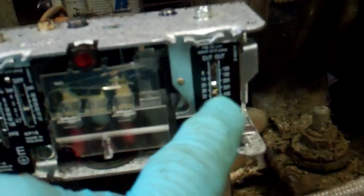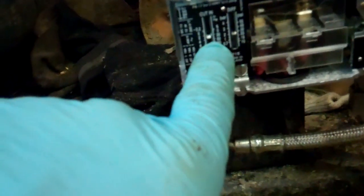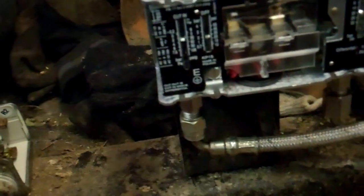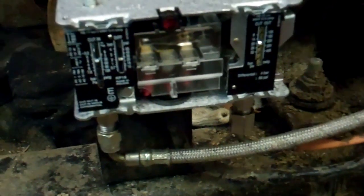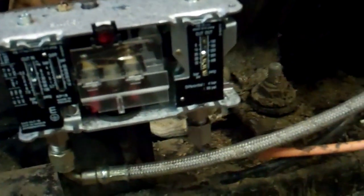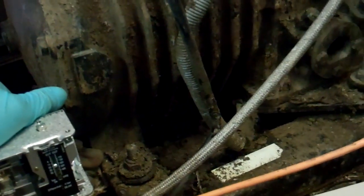We've approximately set it — it's just over 300 psi cut-out on the high side, which probably has a fixed differential, usually about 70 psi on the Ranco ones. On the suction side we've got the cut-in set to around 40 psi and the differential about 30, so it'll cut out around 10 psi on the suction. That's plenty — you should never run that low normally. It's high enough to stop any moisture getting in should there be a leak, and to stop it cycling too rapidly if it pumps down.